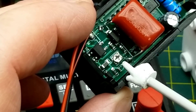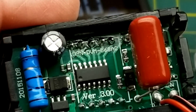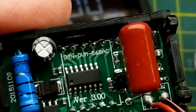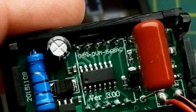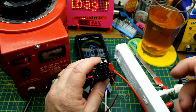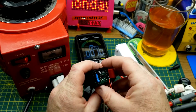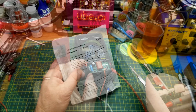I don't know realistically if I'm going to be powering stuff off the variac below 50 volts — maybe I will. But this fits perfectly in that little spot, so that might be better once I run the calibration on it. There is that little calibration pot they were talking about, so it shouldn't be that hard to calibrate. There are 10 pins going to the LED, so I'm assuming it is some sort of multiplexing — might be charlieplexing like the other one. I'll have to tear this one down as well, but I'll wait for the next variation before I do.